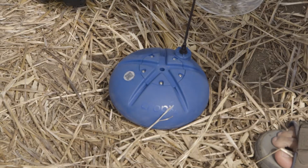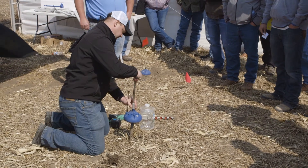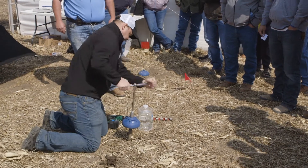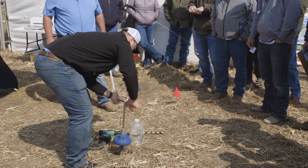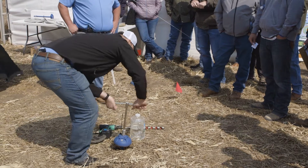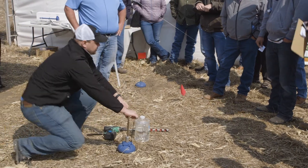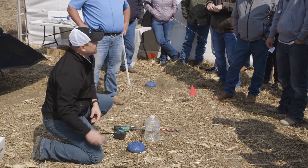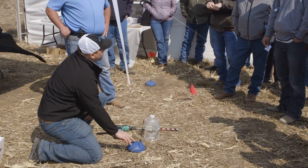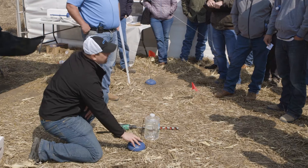You can just take your little key that sits on top here to finish screwing it in. You'll just screw it down until it's flush with the soil — that'll give you your proper depth. Once you get that screwed in, you're basically done with the physical installation. There's a QR code scanner right here that helps geo-reference the sensor just from your smartphone in the CropX app.